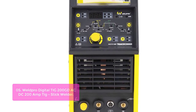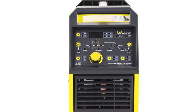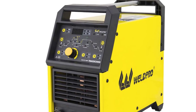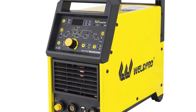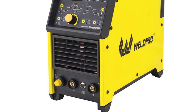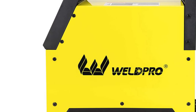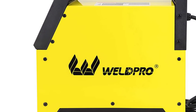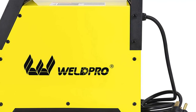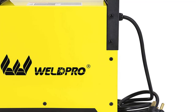It features a full-function digital interface with many options such as start and end amps, upslope and downslope, fully adjustable pulse, AC frequency, and if necessary, the optional super flex cable and super flex torch — allowing you to change between welding steel and stainless steel. This digital TIG welder also features a rocker-style foot pedal without annoying intermediate amperage control. It uses PWM technology along with a greatly reduced size and weight, enabling this welder to be more efficient by 30%. The electronic circuitry enables this AC TIG welding machine to afford the user a far better range of settings for each specific weld. It is capable of both HF-TIG and stick welding.